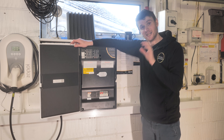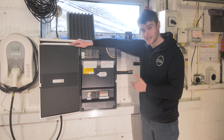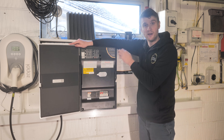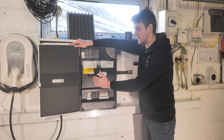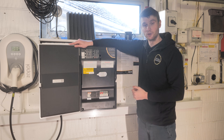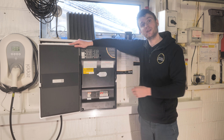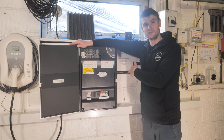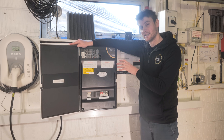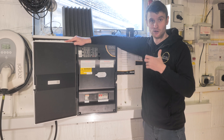The difference is that the Tesla doesn't have a CT clamp for monitoring the grid — because the grid is actually wired straight through the Tesla gateway. It needs that physical connection so it can disconnect it in the event of a power cut. It monitors the grid through a little energy meter physically wired with the main incoming supply tails. This is actually more accurate than a CT clamp, as a physical connection allows it to be metered as accurately as your main energy meter. One less element to go faulty, and it's essential for the off-grid protection.